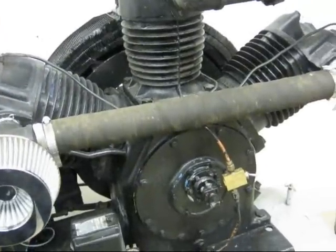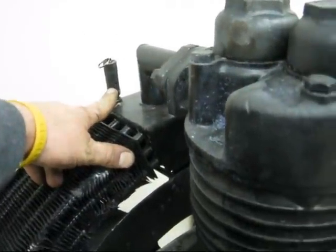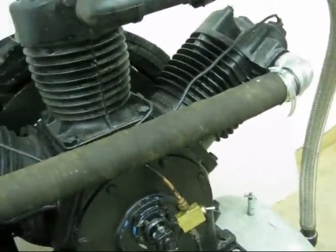It would safely run continuously at 200 psi with a big enough motor, but I know there's no way this motor would do that. It would stall before that point. And in case there's an imbalance between the two stages, there's a pressure safety valve here. If the first stage is trying to do too much of the work, that'll pop off to protect the pump itself and indicate that there's a problem.